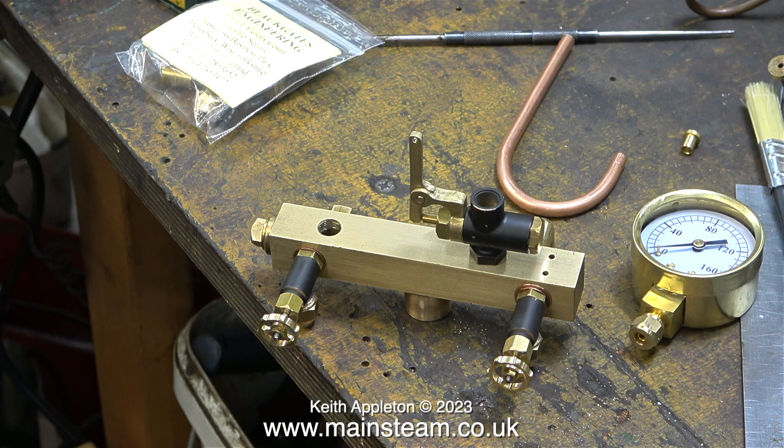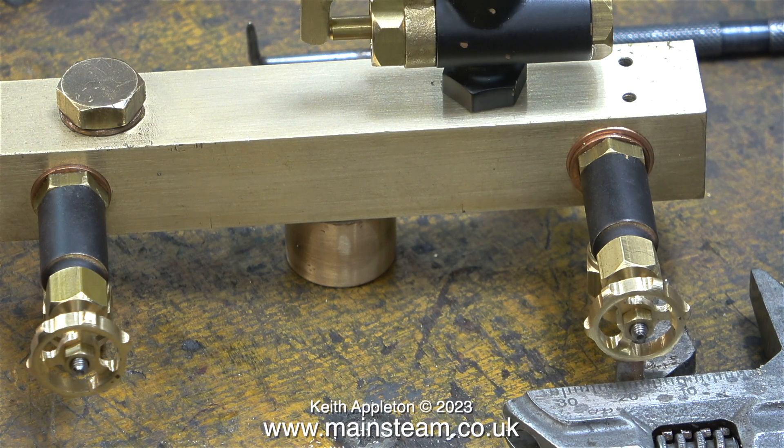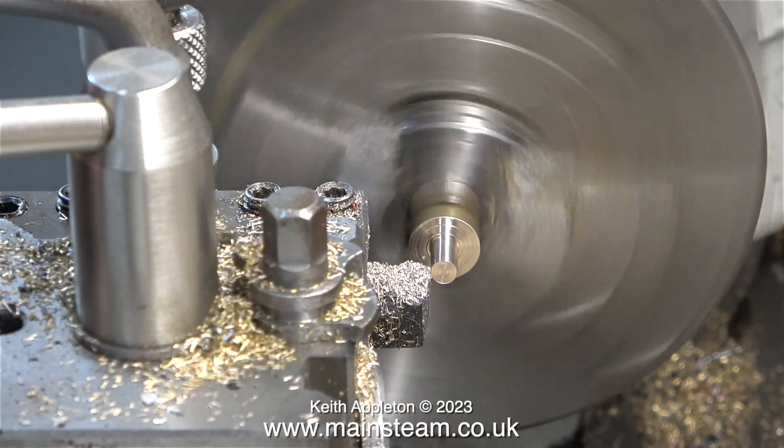Here's a siphon next to the pressure gauge. Before I silver solder the fittings I have to make one of them. This is a whistle valve I showed when unpacking the parts. This valve is designed to have a whistle screwed directly into the top, but that would be no good inside the cab. I'm going to fit a 3/8 by 32 threads-per-inch adapter so I can pipe it to the whistle, which is mounted on the spectacle plate at the front of the cab.